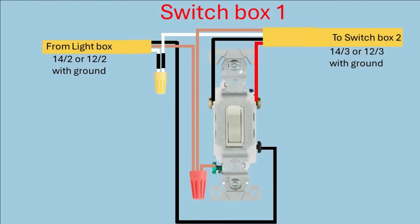In the junction box for the first switch, you've got the 12-2 or 14-2 wire from the light junction box and a 14-3 or 12-3 wire going to the second switch box. All grounds are connected together using a pigtail to the green screw on the switch. Connect the black wire coming in from the light box to the common screw on the switch, and connect the black and red wires to the traveler screws. The two white wires are connected together, but these wires are no longer neutrals — they are carrying voltage — so you must mark them both with black electrical tape to identify them as hot wires.